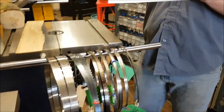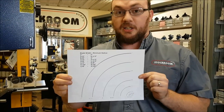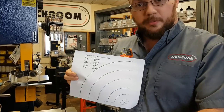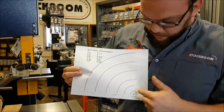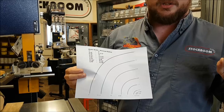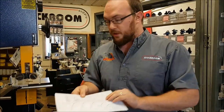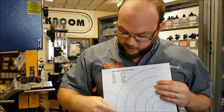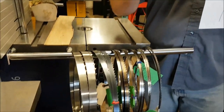Here's a cool little chart you can pull up on Google that gives you a baseline of all the different curves these blade widths can potentially cut. If you're doing scroll saw type work you're going to want a thinner blade. I often use a three sixteenths blade — the minimum radius is five sixteenths of an inch. If I have a lot of resawing to do and don't need to cut curves, I'll use a wider blade like five eighths, three quarter, or one inch. So: wider blades for resawing, thinner blades for curves and scroll saw work.